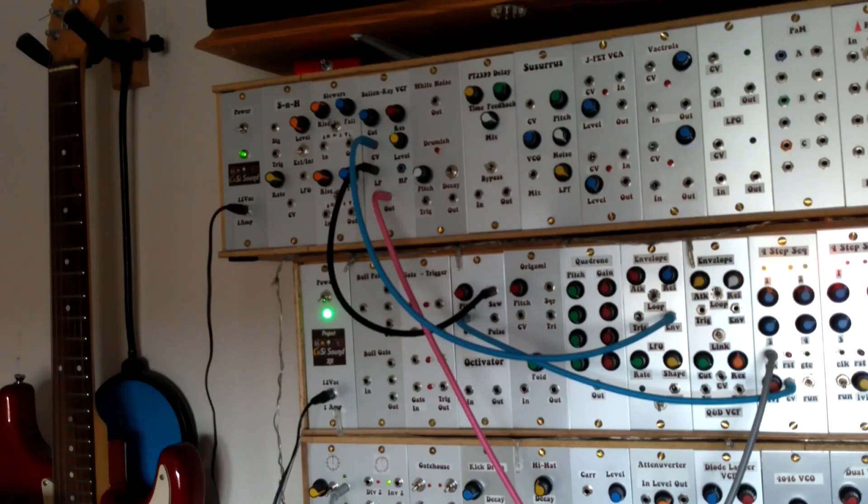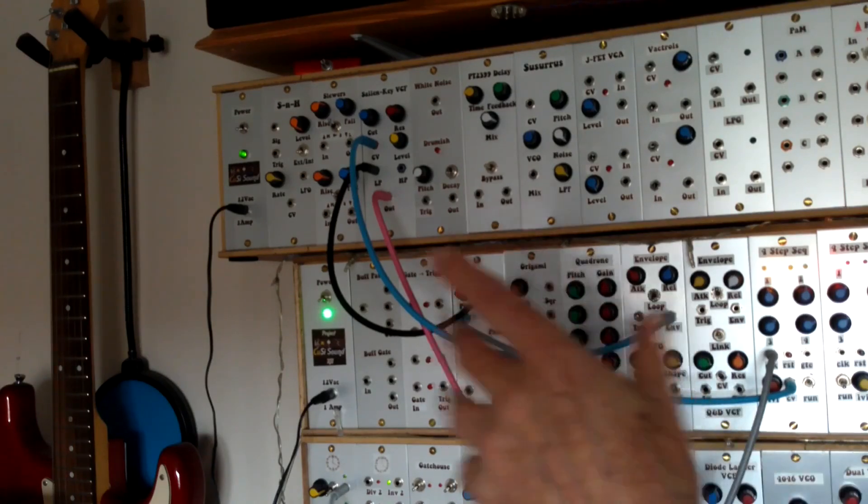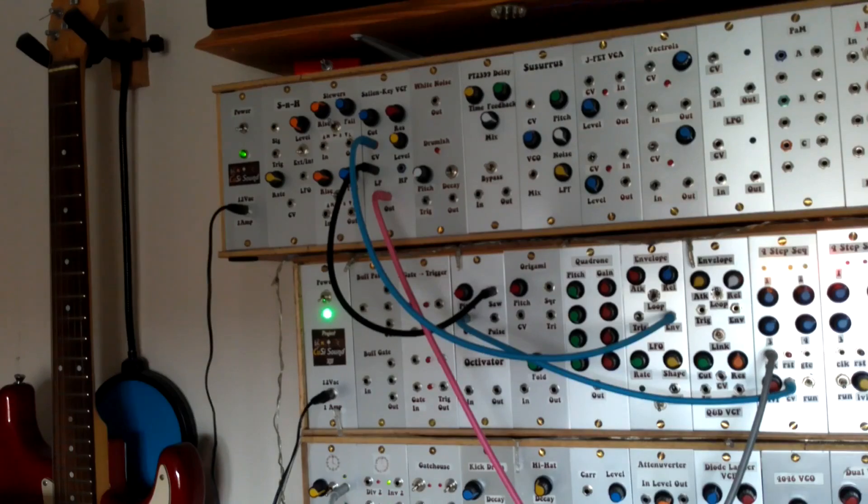That's just a very short simple demo to basically demonstrate the functionality. If I had a second VCO I could have shown you both the low pass and high pass working together. I've kept it simple just so you can get a feel for what the filter sounds like. You've got a link to the Barton site to look up the information and circuit diagram, and a Dropbox link to my stripboard layout. So if you fancy having your own Sallen-Key VCF, why not — go on, have a go, build your own.